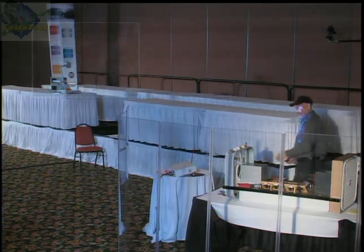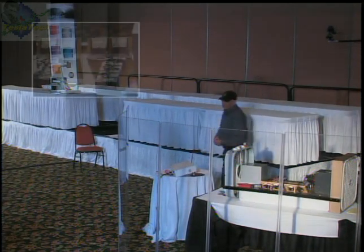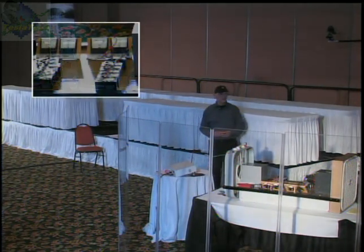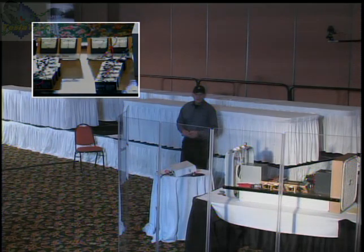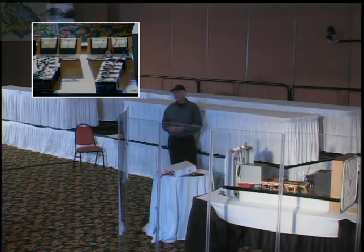Okay, so this fan is going at 570 revolutions per minute, and the other one is going at, what, 530, 540, Gloria? 516? Oh, 526, okay. They're a little unequal. We have a correction curve for inequalities like that. You know, it's hard to hit exactly the RPM.